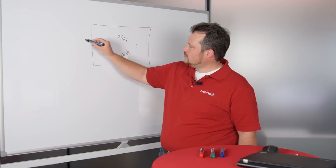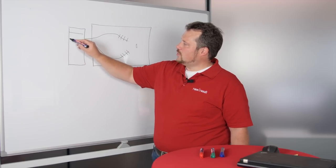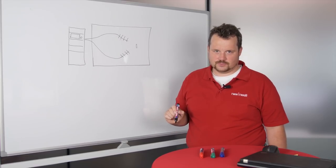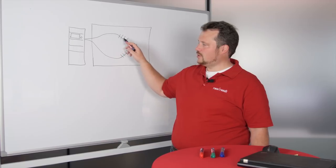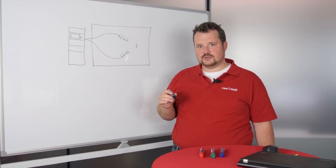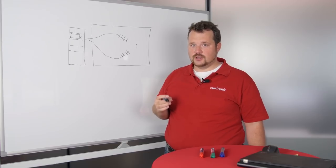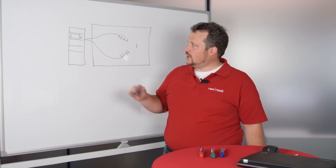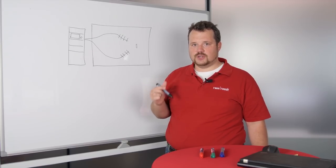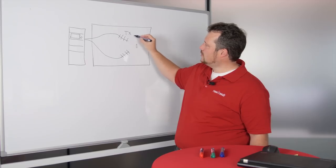The antennas are connected to a pile of test equipment outside the chamber. With this equipment we can actually simulate an RFID reader — we generate the RF pattern that normally comes from an RFID reader. By simulating this we can exactly configure the reader: we can tune the output power very precisely, tune the frequency to whatever we want, and configure parameters of the RFID protocol, sweeping through frequency, power, and different parameters to test the transponder.